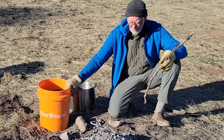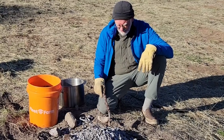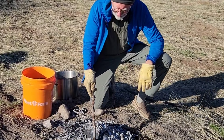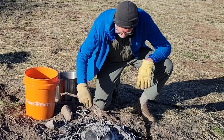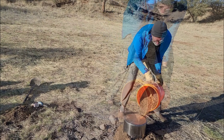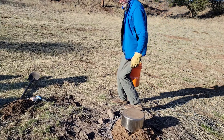It's pretty well burned down now. It's all oxidized and it didn't get as hot as I would like it to. The very highest temperature I saw was 800, and a lot of it was in the low 700s. So I'm going to clear this away. There's still a fair amount of black on the bottom of the pot — fire clouds — which is not necessarily a bad thing, but ideally it is pretty white. I'm going to cover this up and then start sealing up the bottom. So hopefully it got hot enough and there was enough of a reduced environment. We're cutting off the supply of oxygen so the red paint will stay black.